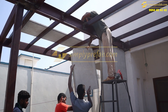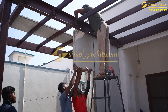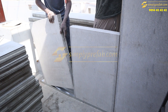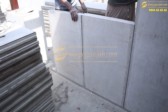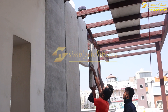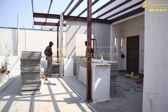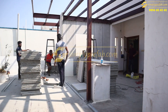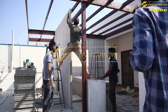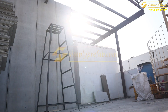These panels are two feet width and ten feet height — basically two inches less than ten feet height — and they are customizable. These are the lintels which we use on top of the door opening. We have cut the panels accordingly, and the window opening is done similarly. The wall panels can be customized as per the design and requirement. This time-lapse shows the walls being placed on the whole structure, with a main door entrance provided.